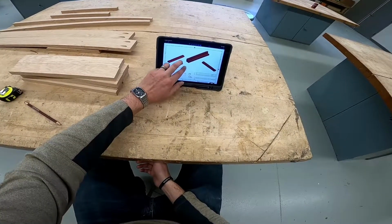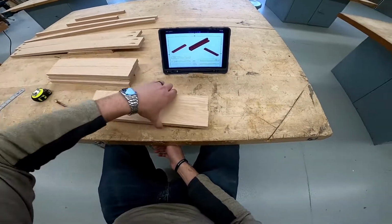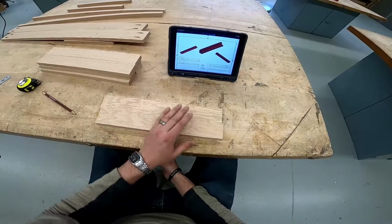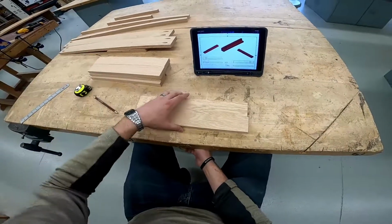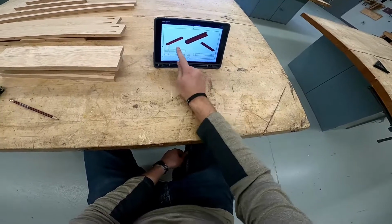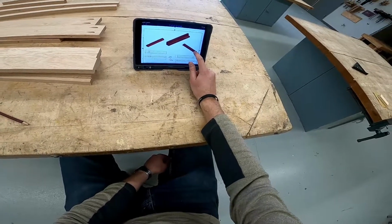Okay, so on the handout for the legs, you'll see that we are going to be putting two 2-inch by 15.25-inch pieces together to make that one leg with that 90-degree angle in it. As of now, they have all been identical. They're just 8 boards, 2 by 15.25. Eventually, they will be a left and a right. There'll be a dado on the bottom with a bevel to the right of it, and then a dado on the bottom with a bevel to the left.